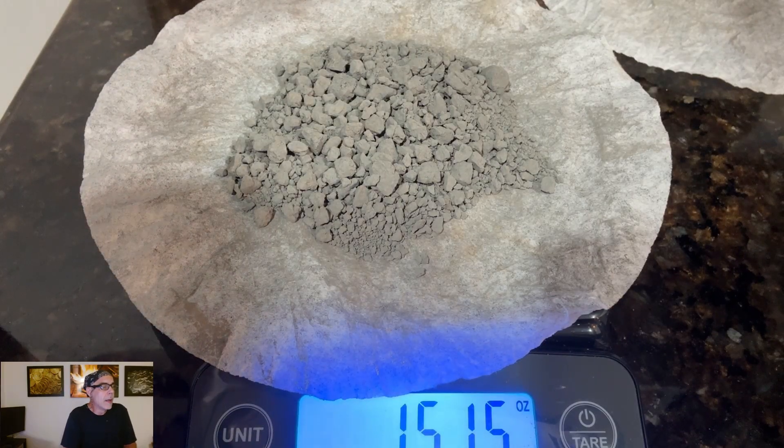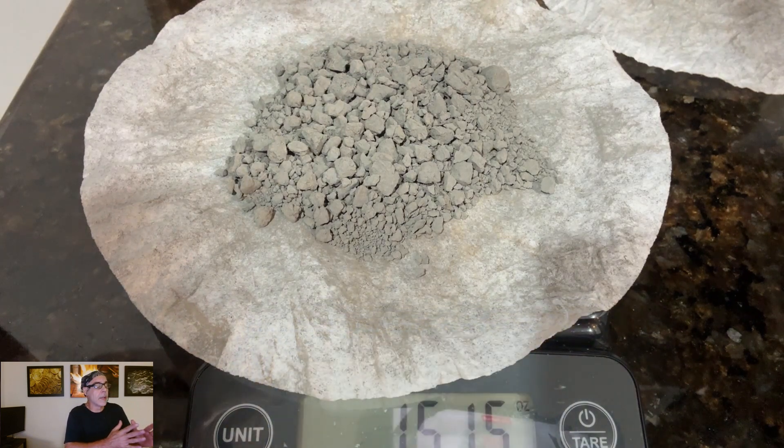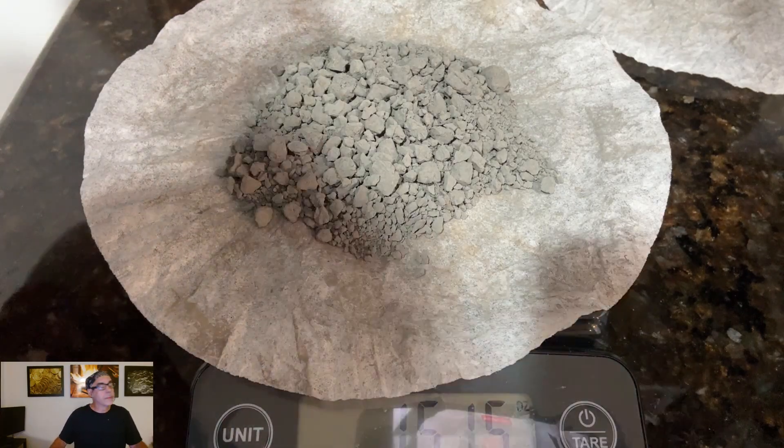That other lot was a mixed batch — some silver, some standard plate, some inlaid, a little double and triple plate, but mostly single-plated flatware. I will not melt this yet; I'm waiting for my nitric acid to arrive. I'll re-dissolve it in nitric acid and use this as the electrolyte for my electrolytic refining cell that I'm going to build next. Thanks for checking it out — see you next time.